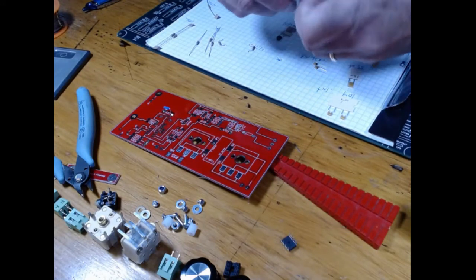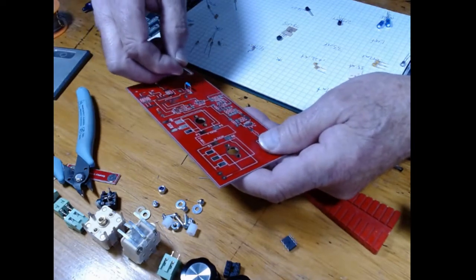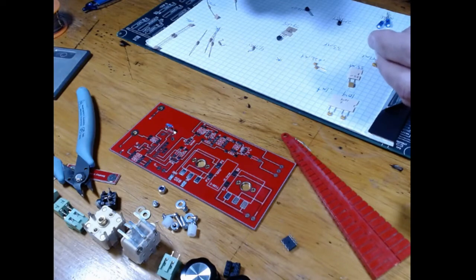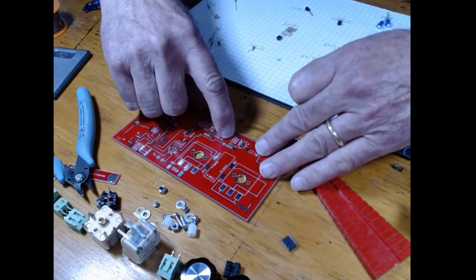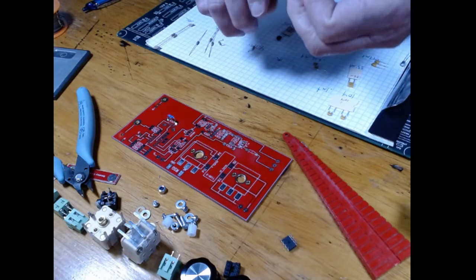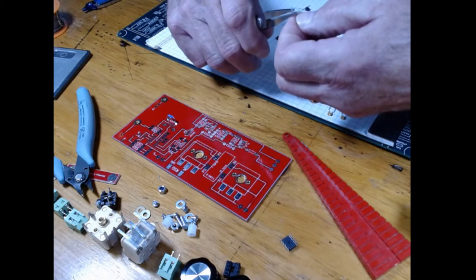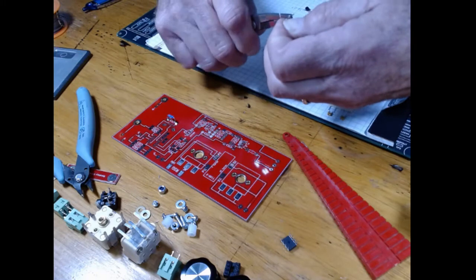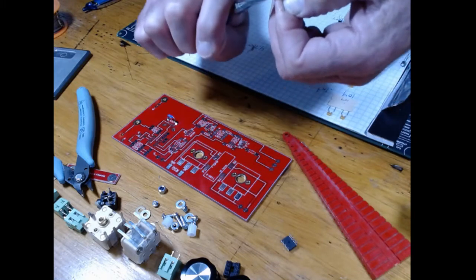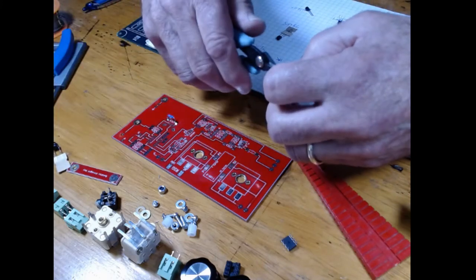And you do that. Now these capacitors are already 0.2 spacing. And if you look, most of these capacitors are exactly the same width as the resistors. So you have to sort of spread them out. I'm looking to see some of them have no traces underneath, so you could make them long feet and then cut them to the right length. But you can also just take these and get an extra bit of width. I'm doing this by eyeball because I've been doing it for so long. I'm just forming this by eye. I'll cut these feet down a little bit so they're shorter.